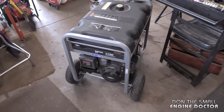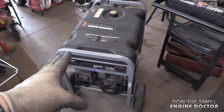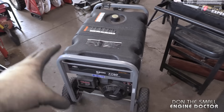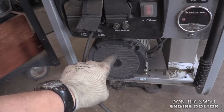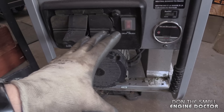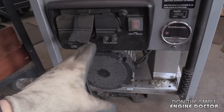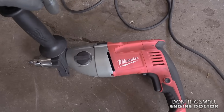Like I mentioned before, it's really rare that I have to flash a generator that is brushless. I'm not sure what's wrong with this one, but it keeps losing its power or its charge. Apparently the people did put in a new AVR inside here and it still did the same thing. So at this point the generator works, but if you put it away for a few days or a few weeks you do have to re-flash it like I did with the drill.